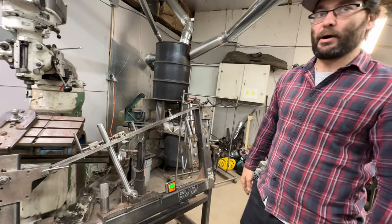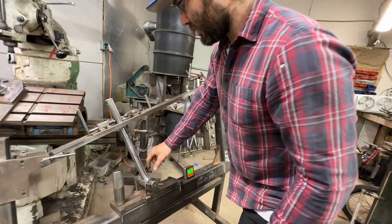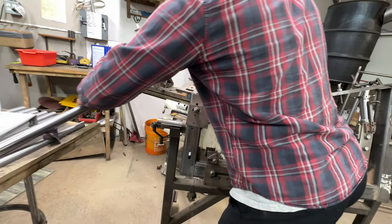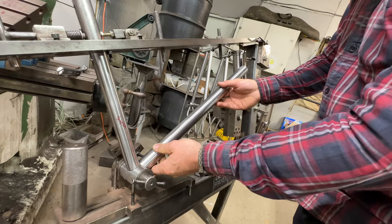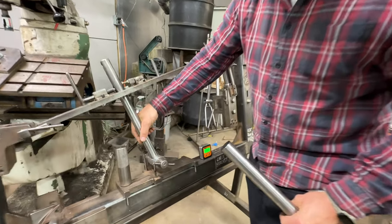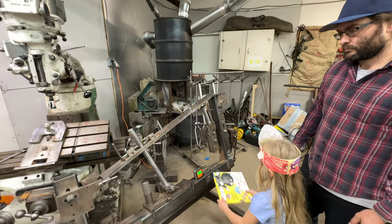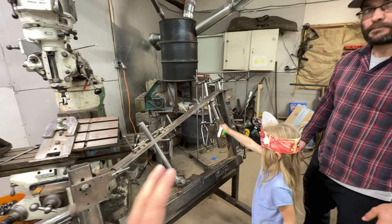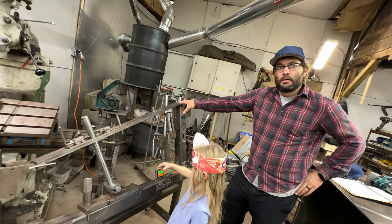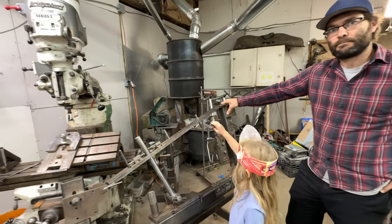I use this for setup — for checking my miter angles and everything. I started re-tacking these things so that for different bottom bracket heights there's a stop, so it'll hit the stop and it's centered every time. I don't have to do anything. There's a stop on the back side of the seat tube as well. Basically what we're looking at here is just how you make sure that every frame of that geometry in a run is exactly the same thing.